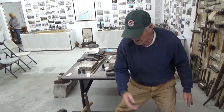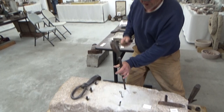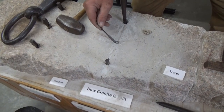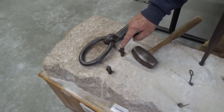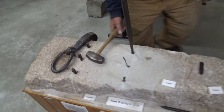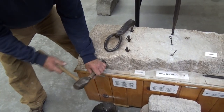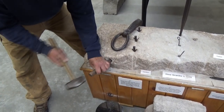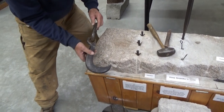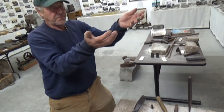Now we can walk around the block and start breaking it down in the hard way. Strike, turn — now taking out the stone dust with the spoons. Putting the smaller version of half-round and wedge, and now breaking that block. Now we have that block free — two free sides. Now we're building with the point — the dog hole. That dog hole is made by hand, and now the dog is put in. And now lifting the stone and transporting.